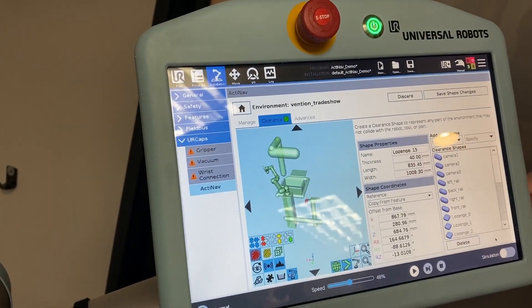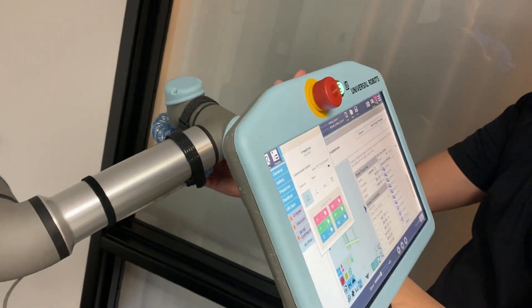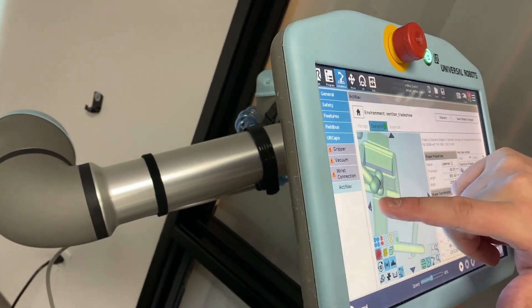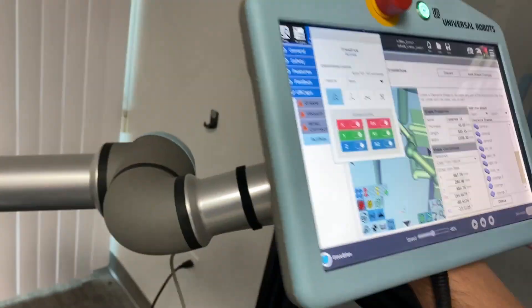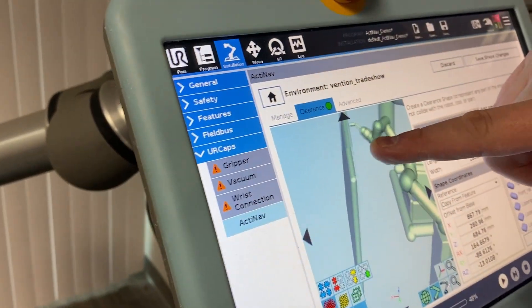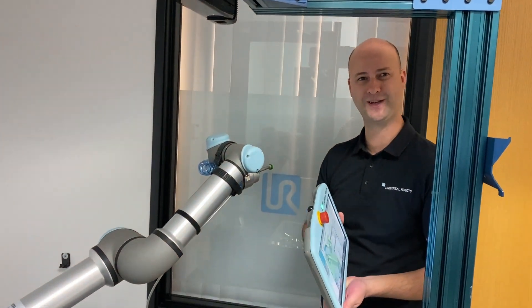When we hit done you're going to see this new shape appear on the left side. Hit done — and there it is, there's the shape. So now that robot, that end effector, and that part will never go through that plane. You can see in the UI I've just moved the robot through that clearance shape — it will never do that, it will never get any closer than that. We're going to do the same thing again for this back wall here, then we can extend the planes and we'll have a nice safe working space for the robot.